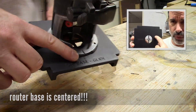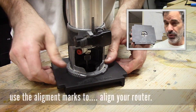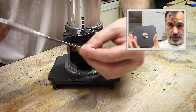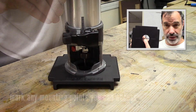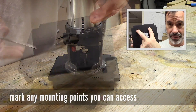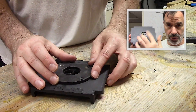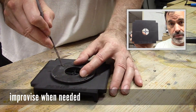There are crosshair alignment points and a crosshair with a bullseye in the middle. What you do is take your palm router, put a quarter-inch or six-millimeter bit in it, and slide it through that hole. Your router will go in with the base on it, so it'll be centered perfectly. You'll be able to access some mounting points from the top, mark the base, remove your router, drill holes, use appropriate length screws and a washer on the bottom to mount your router to this base.